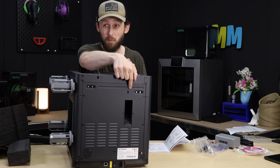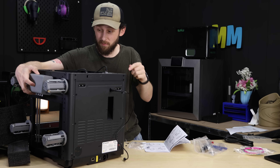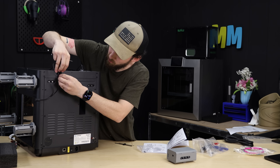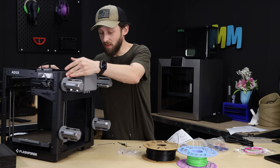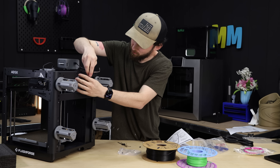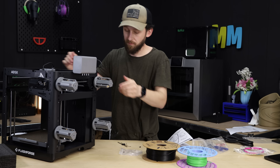On the back side of the machine, there's a little port to install the cable for the IFS itself, so that will go there. The IFS gets mounted over on this side of the machine, and there's another mating port right here. On the back side, there are two screw holes used to attach a little clip which the cable gets routed through. This is the power cable for the IFS. I put this bracket on upside down — that's why you've got to read directions first. That works a little better now.